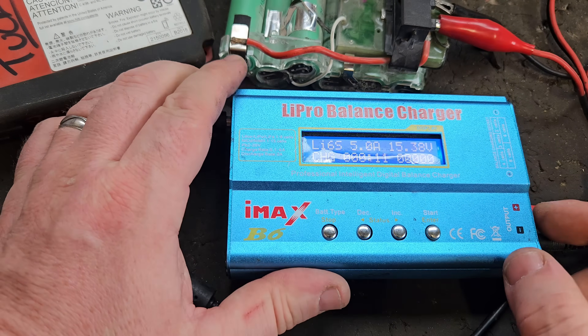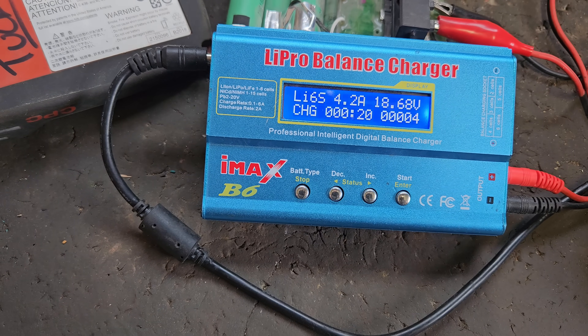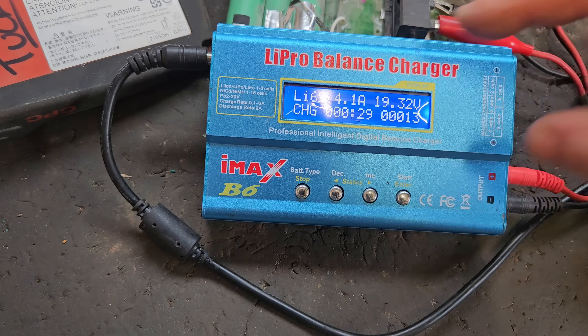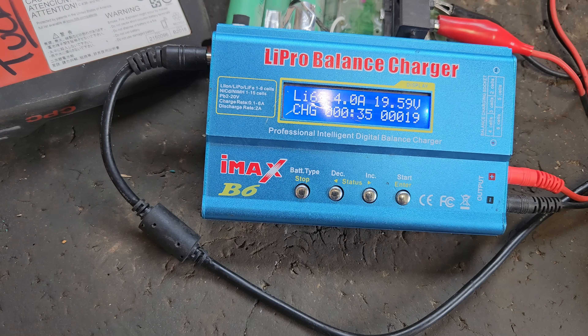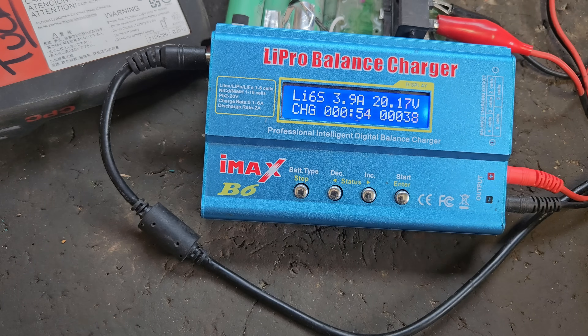If you want to buy this charger, it's a very useful thing — if you have a lot of batteries lying around and they get discharged. I'm going to put a link in the description and in the comments section. We're going to have to leave that a little while until the amperage comes down. The voltage will rise and the amperage will come down, and it'll tell you when it's full. Now we should have a charged battery. Even if we get her up to 15 or 16 volts, she might charge — let's get her up to 20 anyway, and she'll definitely be within the safe zone.